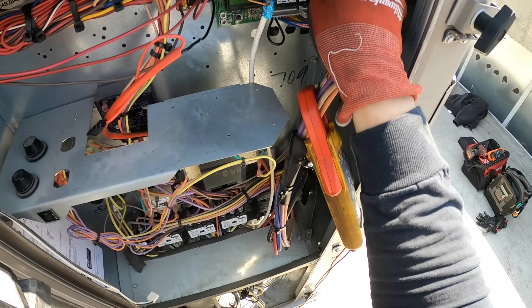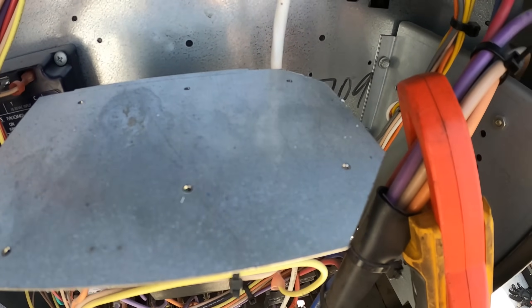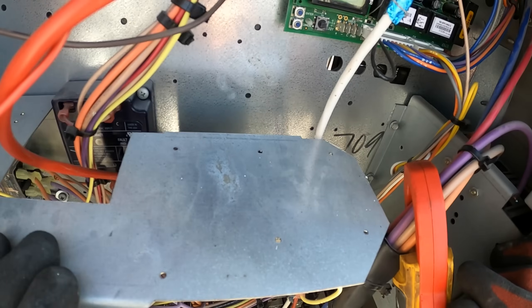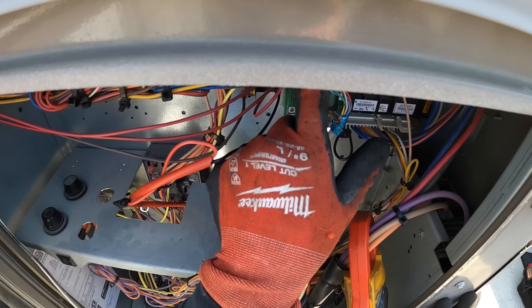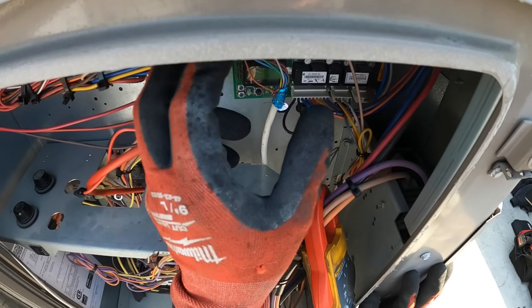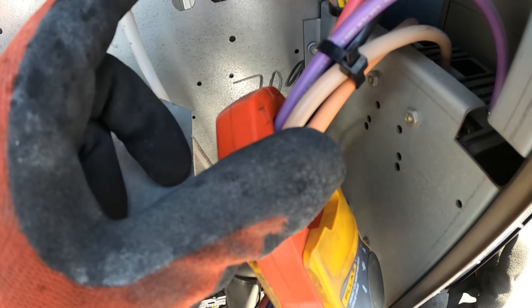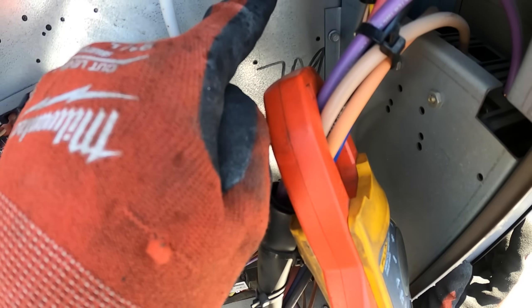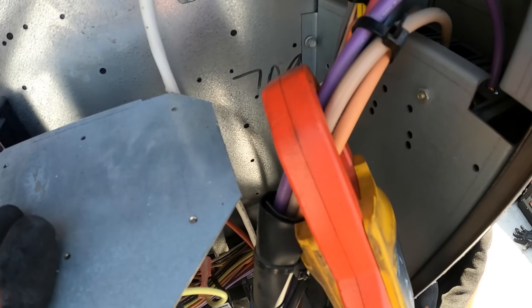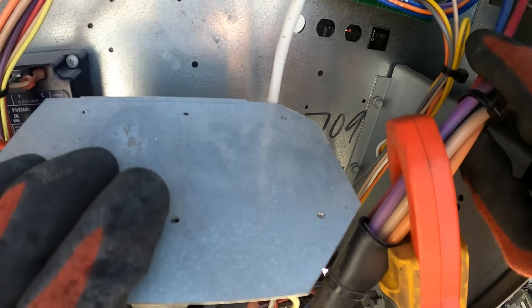These sensors probably all got walked out once the pressures got messed up, which then messes with all the temperature readings. A clogged air filter could be causing a lot of problems. This is our thermostat cable coming from downstairs. We also have some kind of limit switch — probably for heating — and then low pressure switch LPS1, high pressure switch HPS1. Those are the four pressure switches — two low, two high for two circuits.